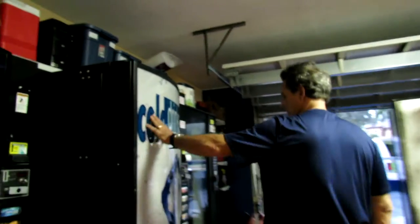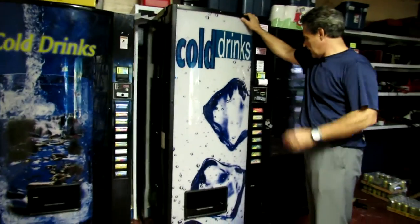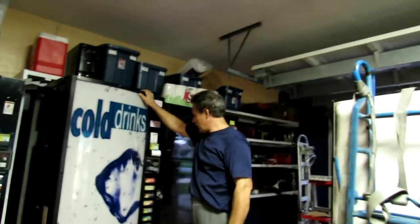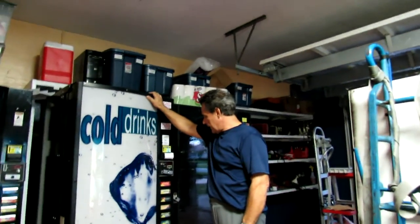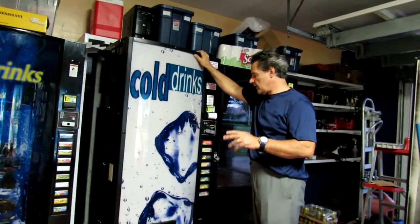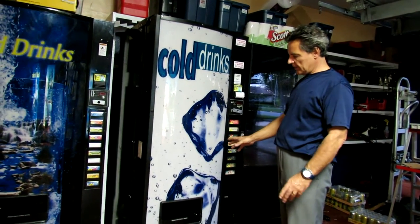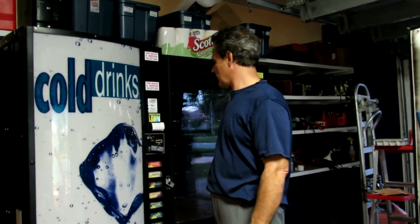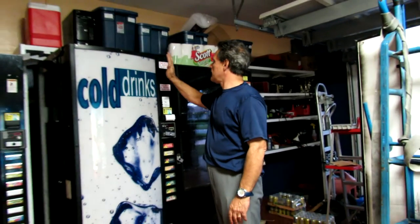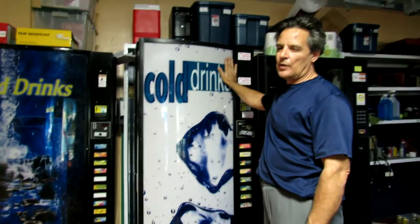I may just start buying stuff off the road. This machine is a 650 capacity and this is a 542 — excellent machine. I took it off location the other day because it was outside under roof, and the buttons started getting bad. The drop sensor — something that activates when the cans hit — wasn't working, so all the cans were coming out. So I switched that out yesterday. The refurbished machine will go to a really good location where there's not a lot of room.